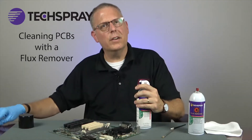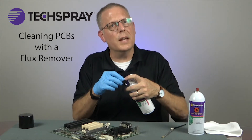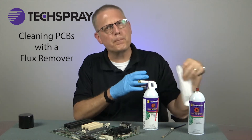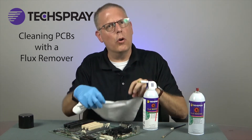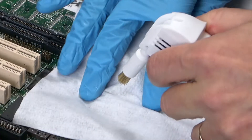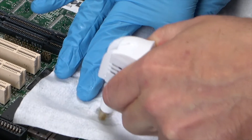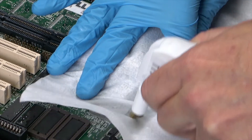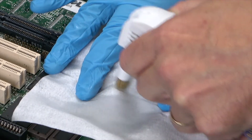When you're done, remove the brush and give the PCB a final rinse. If you have a very isolated area to clean and you don't want to risk cross contamination, you can use a wipe to absorb the flux residues. Simply place the wipe over the component, pull the trigger to release the solvent, and scrub through the wipe. This breaks up the flux residues and allows them to absorb into the wipe.